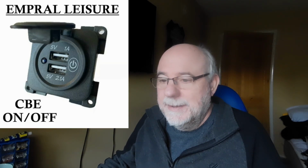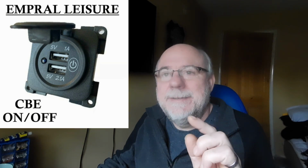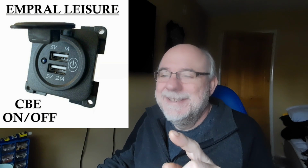A couple of spotlights, of which I only used one in the end. They were $11.56 for the pair. USB socket, $12.99. The USB outlet socket for the CBE unit, that was $13.99. The reason I got that was because it had a built-in on-off switch. However, slight problem with it is that by default, when you turn the 12 volt power on, it comes on, which is not what I really wanted. So in the end, I put it off a separate switch with another USB outlet. So that kind of didn't work quite how I wanted it to.